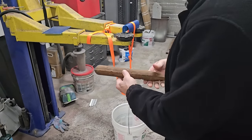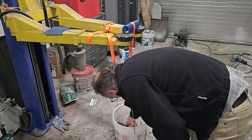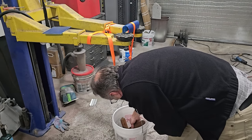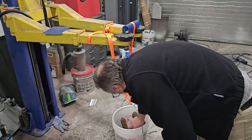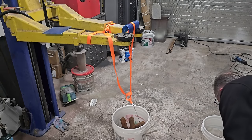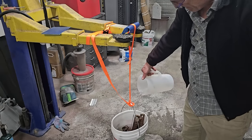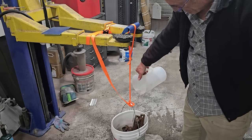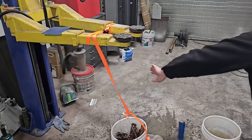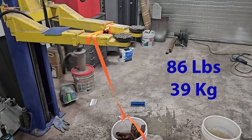And we're about to find out we've got a little problem with this test rig - the arch is too strong for just water. We have to switch things up. I rounded up some iron weights and loaded the bucket with iron before going back to water. About 40 pounds of iron in there, and we can see the sample is really tilting over. It's about to give way - and there it goes. Failure. It didn't fracture but bent and fell over at 86 pounds.